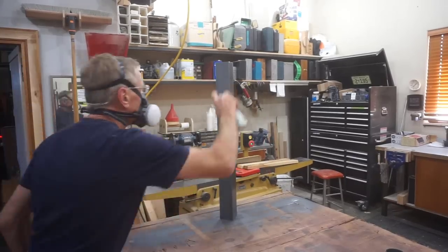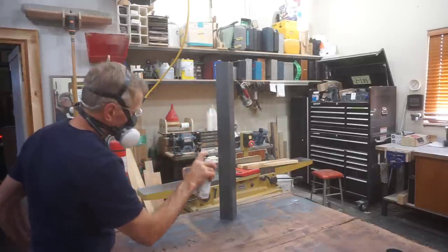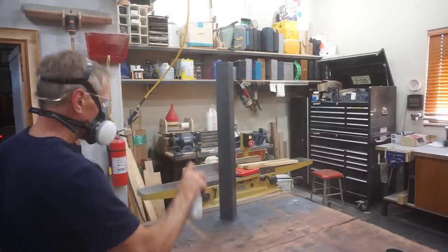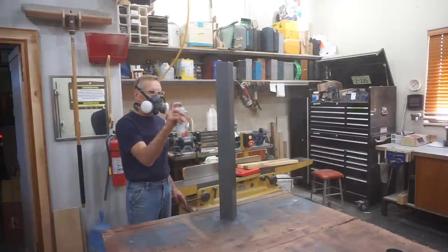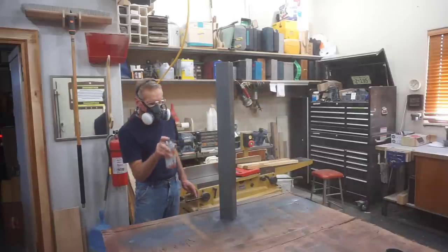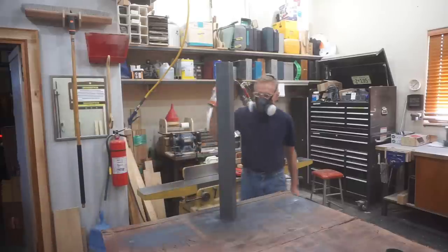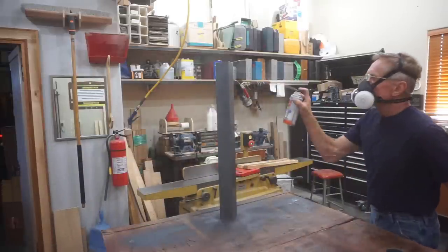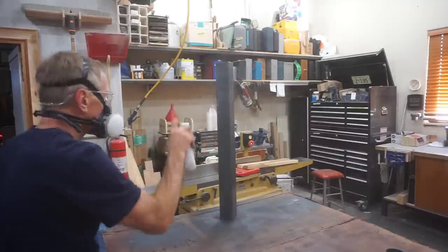While the lacquer is drying, I clean the steel tube with lacquer thinner and a Scotch-Brite pad, hit it with a light coat of gray primer from a rattle can, and follow that up with a full wet coat of a dark gray metallic hammered finish spray paint. This gives it a poor man's powder-coated finish look. A pro tip for maximizing the hammered look is to give the whole piece a full wet coat and, while it's still wet, back off to about 18 inches with the spray can and use a rotating motion to mist on more paint. This sequence really increases the fisheye effect, giving it a noticeably un-rattle-can look when dry.